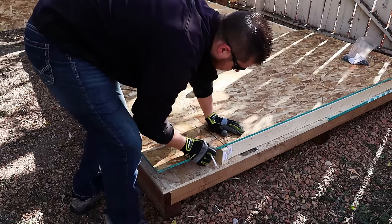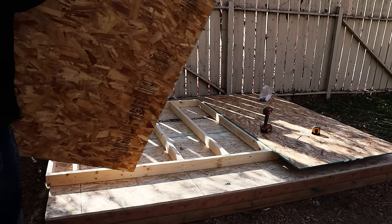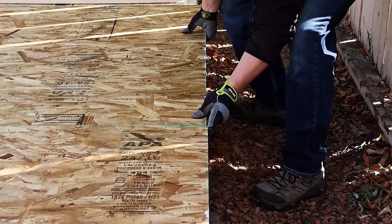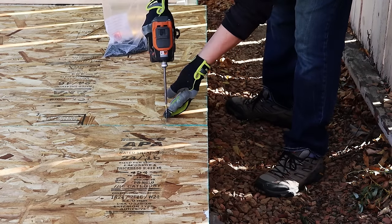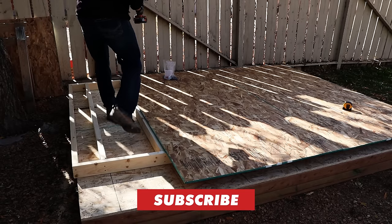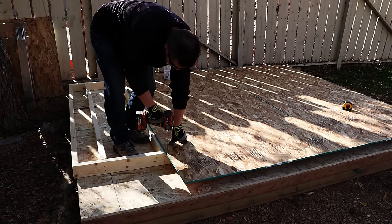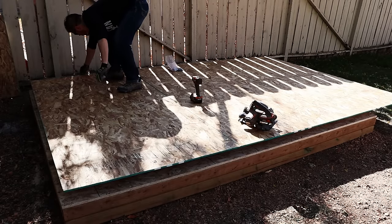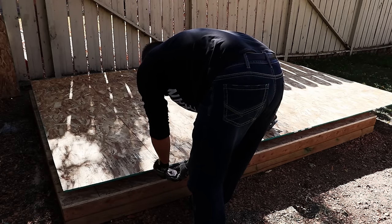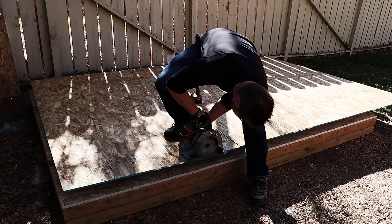In order to make sure that I have my top plate marked, I'm just using a scrap piece of wood to make a reference mark for when I cut the rest of the material off later. With the next sheet of plywood in place, we can again line up the bottom edge, tack that down, and make sure to push the top edge over. That'll self-square the sheet in place and then you can finish locking it down. For our last bit of wall sheeting, you can either measure and cut it off the entire wall, or set it in place, tack it down with a couple of screws, and then cut it in place. I'm just marking the edge of my stud locations with the chalk line and running my circular saw along that in place — I just find it easy.